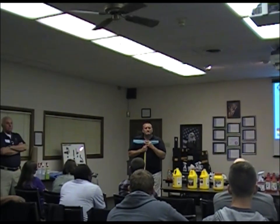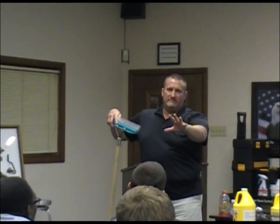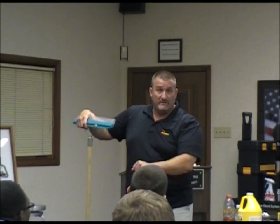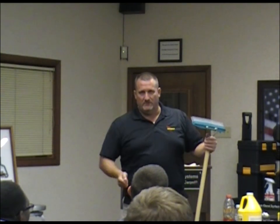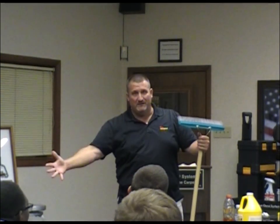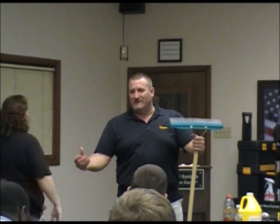No other pre-spray except OS1 on a job like that? Well, normal pre-spray too. First thing: I go in the room, find all the urine, and inject with OS1. After that I pre-spray the carpet with my normal pre-spray where there's no urine, then rinse it out. And after I rinse, I post-spray with the OS1 again. It's almost like a whitener too. It takes care of the odor, the smell, and the stains. OS1 is a silver bullet — it's going to change the world. It's just done really well for me. I'm very blessed — I've been really happy with OS1. It's been a game changer.